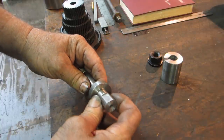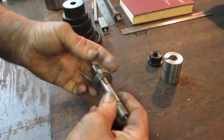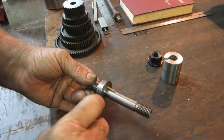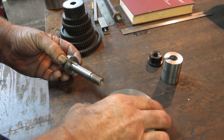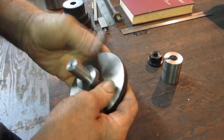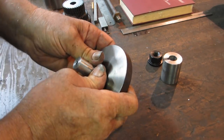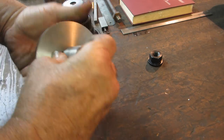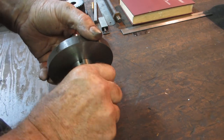3/4, actually it's a CAT 50 3/4 end mill holder. And then this diameter here is 5/8 exactly. And we put a Woodruff key in it. And we got a couple of blanks made up. And they're keyed. So I'll go right on here. Nice and tight, and made this collar with a little relief for the Woodruff key because it sticks out beyond them a little bit, and cut those threads on the little lathe too by hand.